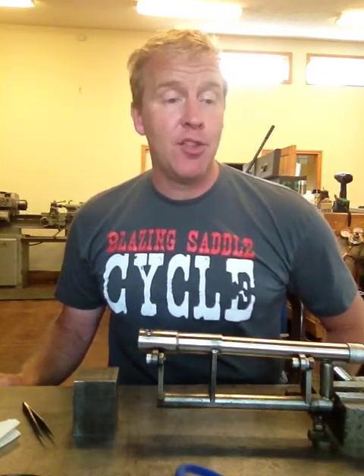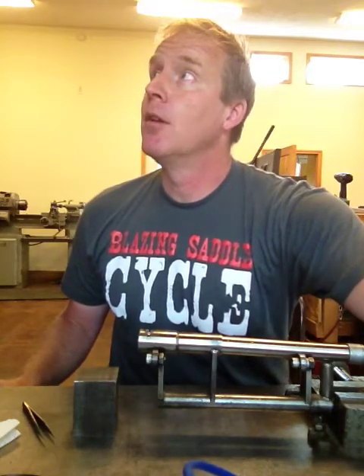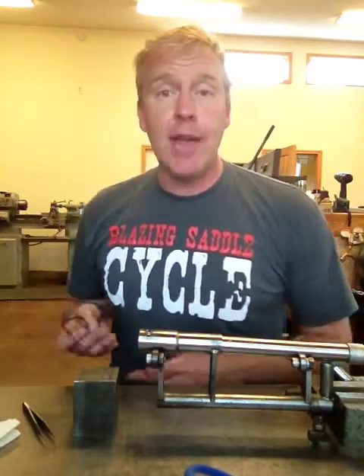I've been purging the inside, allowing sufficient time for it to evacuate probably two to three times its internal surface space. Now I'm going to turn down my gas using my manifold so I don't create any internal turbulence within the piece. And now I'm going to weld the cap on it.